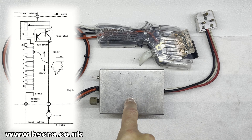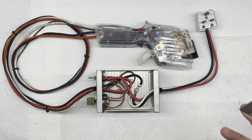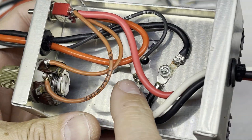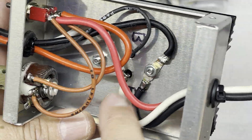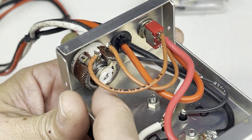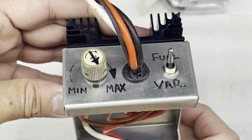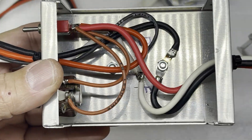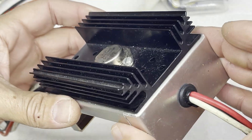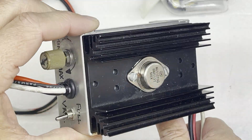Today we're going to look inside this box and see what's in here. So let's open it up and take a closer look. There's not very much inside this box. There are our three transistor connectors - our base, emitter and collector. There's a wire-wound potentiometer in there and a switch. The switch and potentiometer are for adjusting the brakes on the controller. On the other side of the box is the transistor and quite a large, hefty heatsink, because this transistor can get quite hot when using more powerful motors.